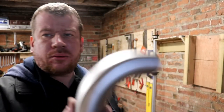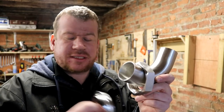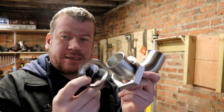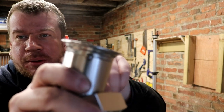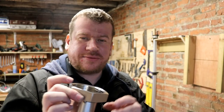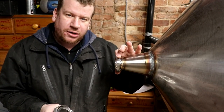I've just taken one of these two inch street elbows - that's what they call them - a two inch RJT nut, and a two inch RJT liner. We're going to be using RJT fittings for this build. I've popped them on the fitting and just tacked them together - not completely welded, just some little tacks. That gives me an elbow which will allow me to get a good idea of the height of the tank before we put any legs on. Here you can see the concentric reducer coming out of the base of the tank with the two inch RJT male part.